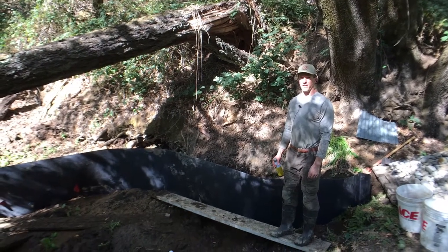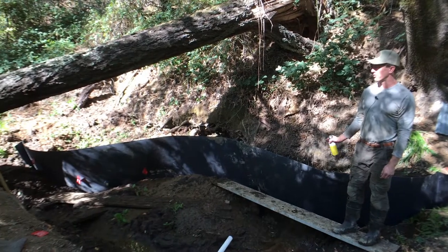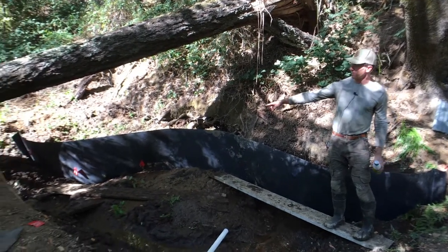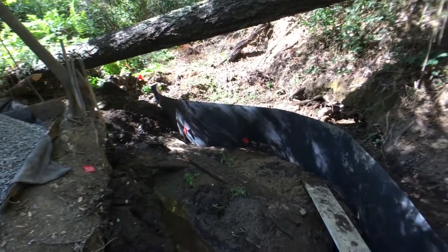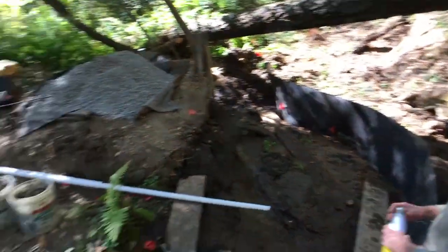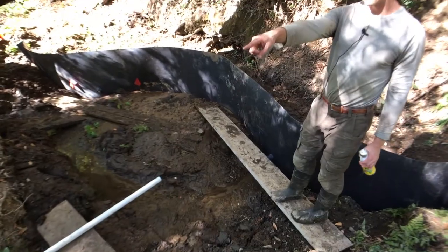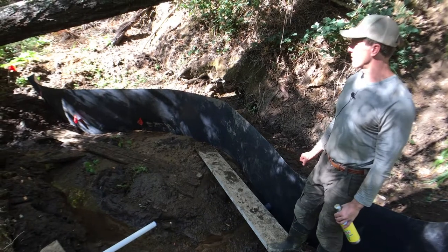This is a midday day two update. We have the wall set in place so we could take measurements to cut our exit holes for the main collection piping. On the other side there's a large bulkhead fitting right there and one right here, and then this inch-and-a-half pipe is estimating where our main two-inch line will be, leading to the green spring box down slope. We've got about six inches of fall between these bulkheads and the top of the spring box — over that distance that's just over two percent grade, which gives us good water movement.